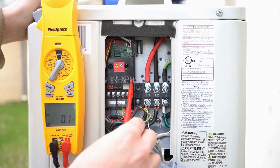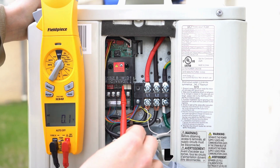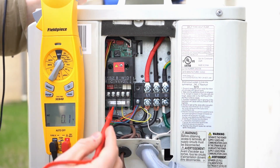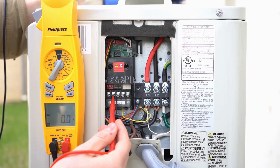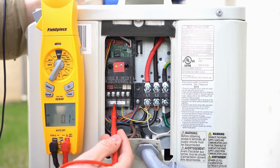There's a little arrow pointing up for that top row. On the bottom row, we've got R, C, Y1, Y2, and L, with an arrow pointing down. What's tricky is on the bottom row there's a plastic cover over the actual terminal strips. Looking at the top, you can see all the connections clearly, but on the bottom it's hard to see — that cover actually flips up.